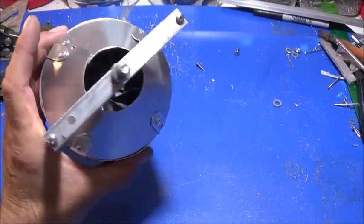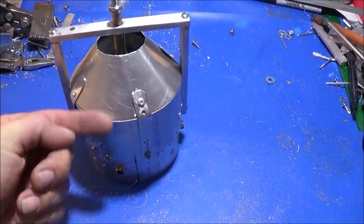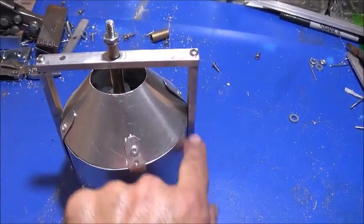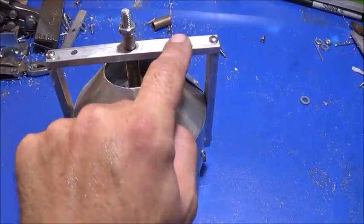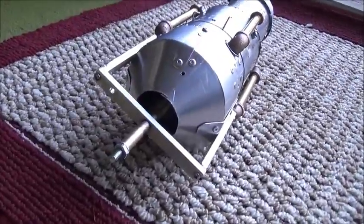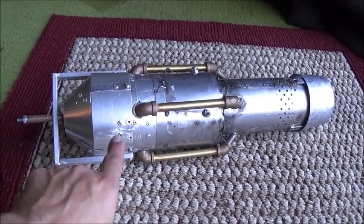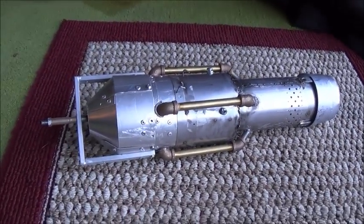This will move a lot of air as our first stage compressor, then down through the entire system into our second stage compressor, with any extra coming out into the ramjet engine. I've also installed a frame — the beginning of the mount for the electric starter motor. I'll build pieces to mount that motor and be able to spin this thing up to 20,000 RPMs. Here's what the compressor now looks like attached to the turbo ramjet engine: we have a large high-volume compressor stage, a turbulator stage, and then our final second compressor stage — everything we need to get this engine up and running.